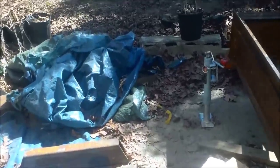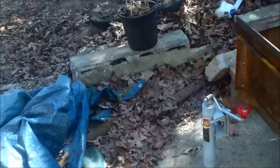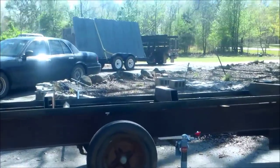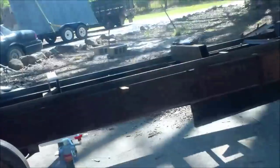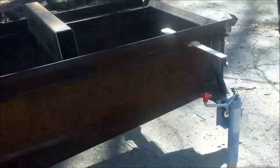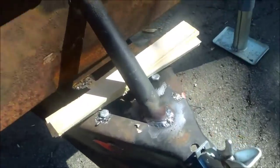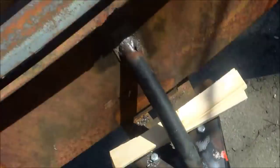My existing jack stands — I'm going to work on 45-degree gussets for them because I saw this one flex a lot under weight. About to weld this 45 up. As you can see, I got a piece of Schedule 80 pipe that's about a quarter-inch thick wall. I cut it at 45 degrees and then cut a piece of flat bar. I finished all my 45s. I also put a 45 going on the tongue down, so it's real strong.